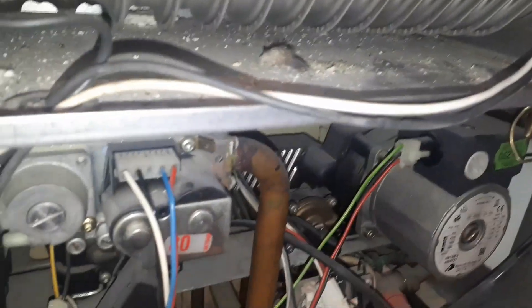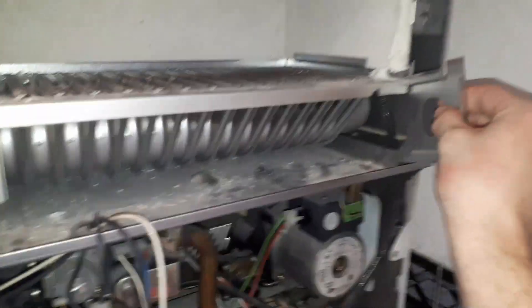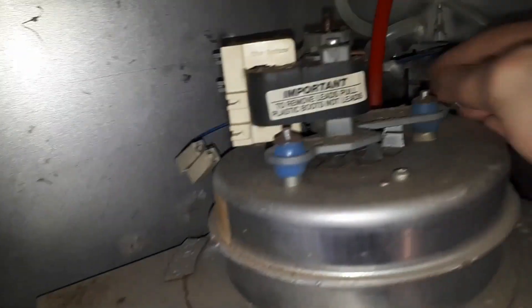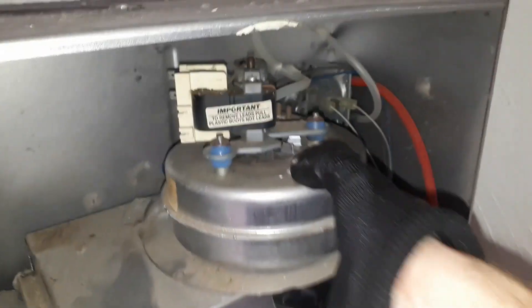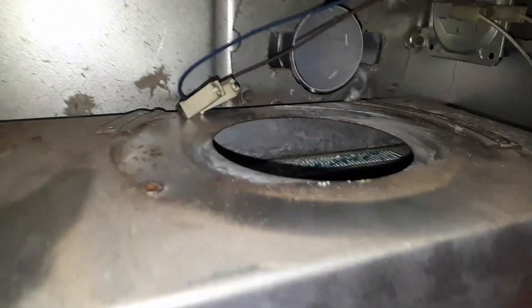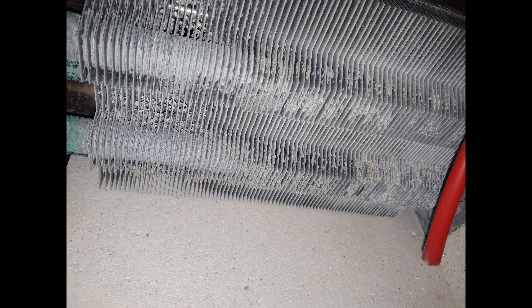Make a note of what colour goes on what tag on the fan, and also note the coloured hoses so you can put it all back together. Pull the fan out and pull the burner out as well. I'll also take out the flue collector — I didn't get a video of that, but take out everything necessary and give it a good clean. Make sure you check the flue behind, check its integrity — run your hand around it, or use a mirror. Here's a little photo of the heat exchanger and the burner — a little bit dirty.